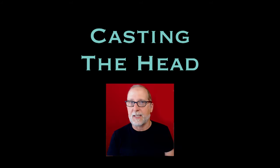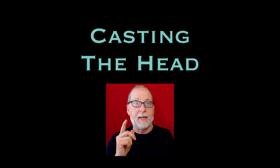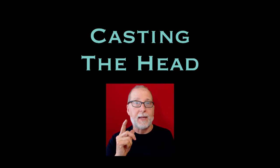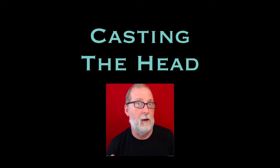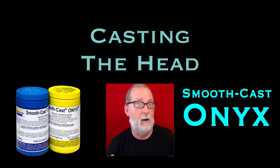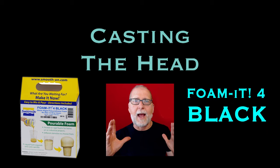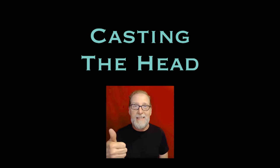It's finally time to cast Savannah's head. Prop Monkey will be casting in resin, so the mold can't have any water or moisture in it at all. If so, it will react to the resin and not let it cure properly. Now, if you're using Hydrocal plaster, there will be no need to dry it thoroughly. Prop Monkey will do a slush cast with Smooth-On Black Onyx. Then he will backfill it with Smooth-On Foam-iT 4 black. This will create a very lightweight and strong cast.